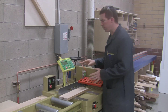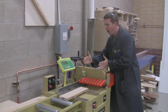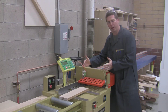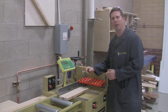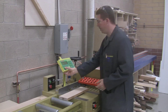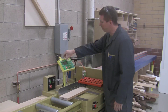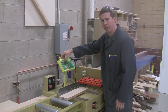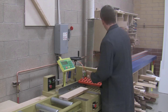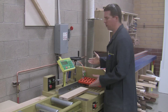The saw can cut up to ten inches wide from front to back. But I have the machine preset to only cut down to eight inches. Anything smaller than that and it will give you a minimum limit warning. The maximum limit is just how long the table is — about a hundred and eighteen inches — but most of our projects aren't that big anyway.